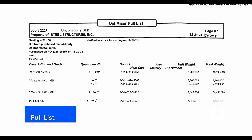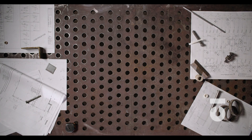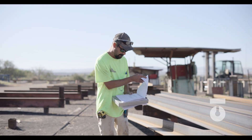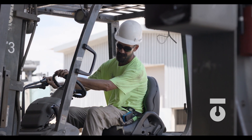Remember, our ticket will reference the material length, heat number, job number, and the quantity of the steel needed to be pulled. You will physically measure the material for accuracy according to the markings and the ticket. You will check quantity if applicable, and once confirmed, you will bring in the material safely using a forklift, crane, or other safe methods.